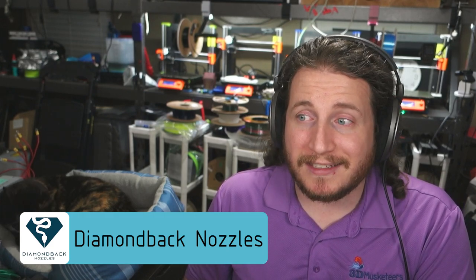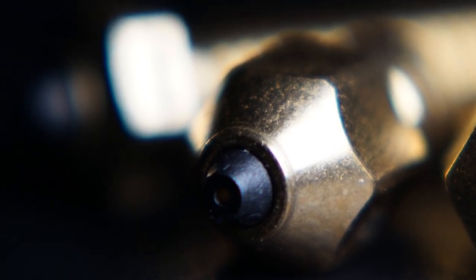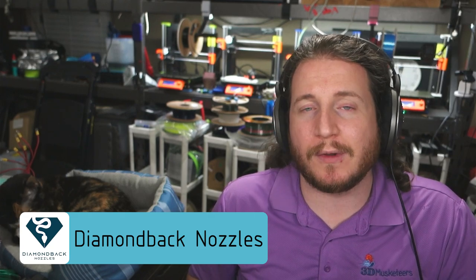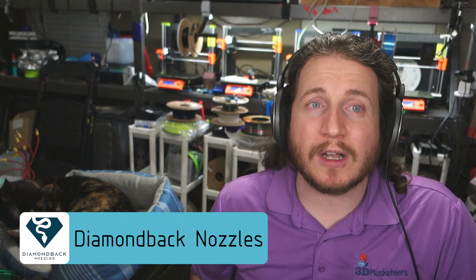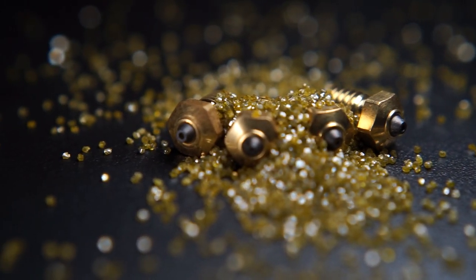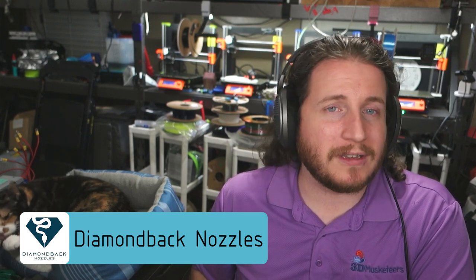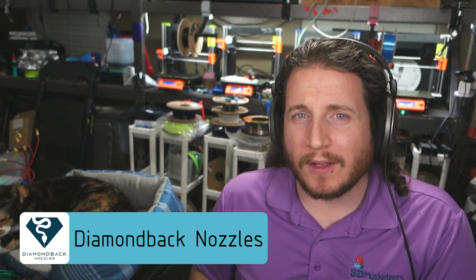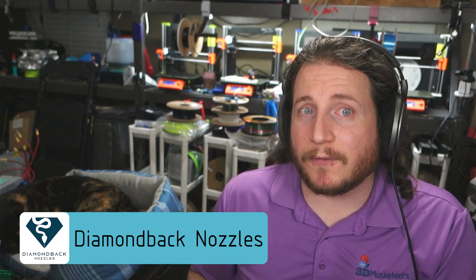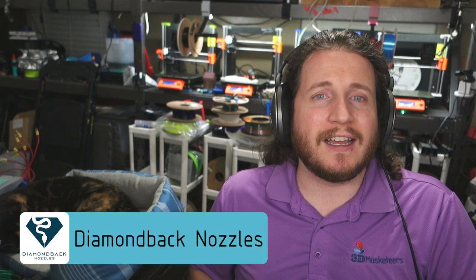You can go back and look at my reviews of their products — it is pretty amazing, and that was even before they knew I existed. We have run well over 20 kilograms of carbon fiber through one of our 0.6 Diamondbacks on the Prusa behind me, and it still works just fine with whatever we want to throw at it. That's a testament to the quality of the polycrystalline diamond structure the nozzle tip is made out of — better thermal conductivity, better hardness, and all-around ease of use compared to hardened steel nozzles. Available in quite a few different sizes and for different types of machines, get yourself a good quality nozzle made in America at a really reasonable price.